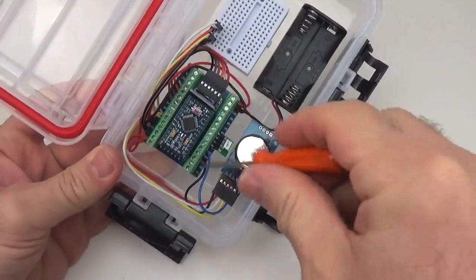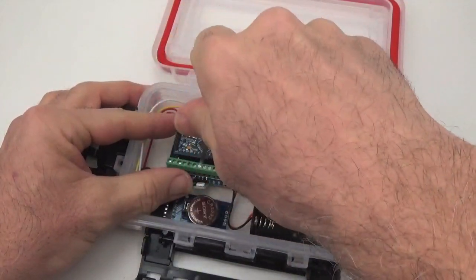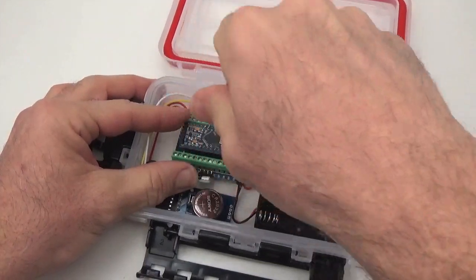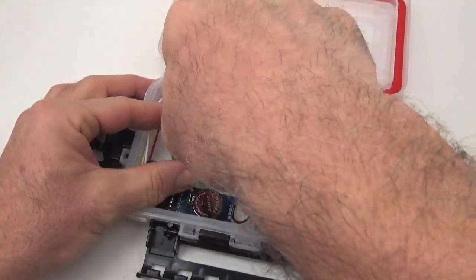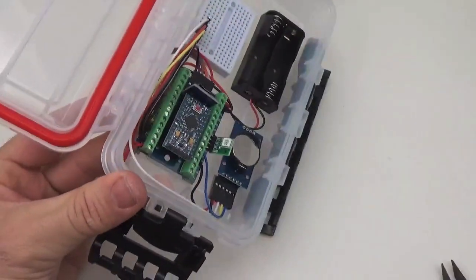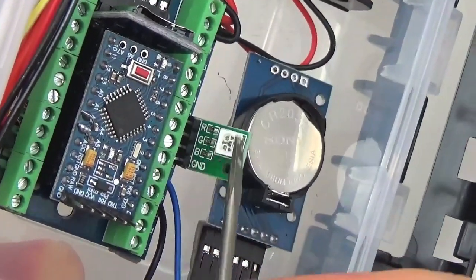I don't use these boards very often. They're not that expensive, but compared to an LED, which is pennies, I think they usually end up charging about 50 cents for one of these boards. But in terms of getting an indicator LED onto your logger as fast as possible in a classroom situation, one of the most common errors is forgetting to put a limit resistor on. You can't do that with these boards because the limit resistor is already there. So there's a limit resistor set already tuned on that 50/50.